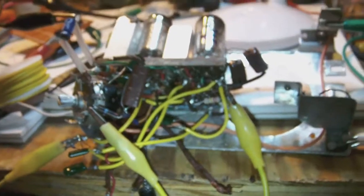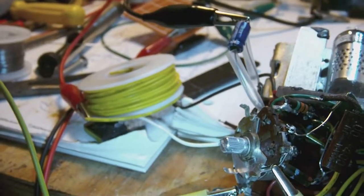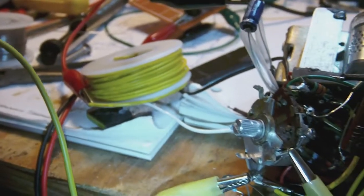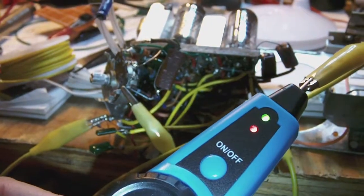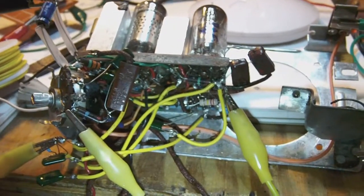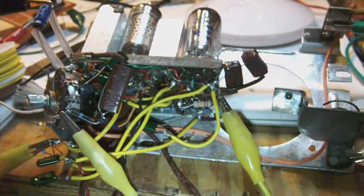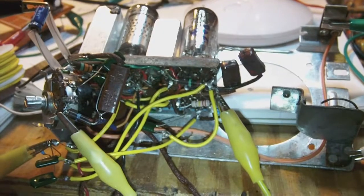Okay, I replaced all but two capacitors, and I'm injecting the 455 kilohertz modulated IF signal via a coil of wire into the antenna, and this is the result. So you can hear the IF signal, so that's a good thing. Now there's also a lot of noise, of course, but it has never been otherwise where I live. There are so many appliances and so much equipment all around me and at my neighbor's place, that it's inevitable I get all sorts of crackling and noises.